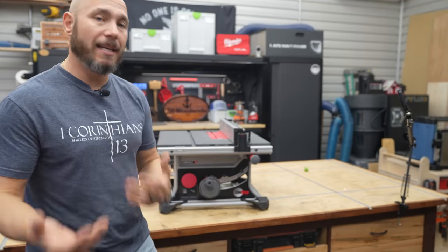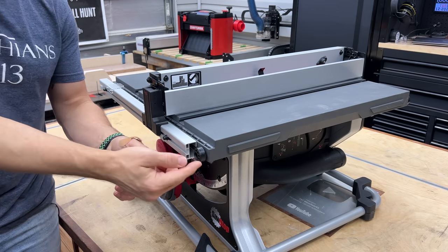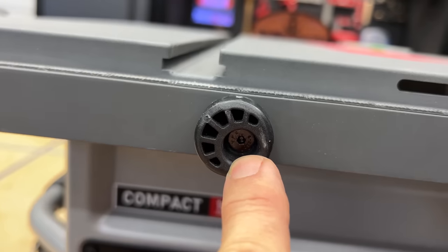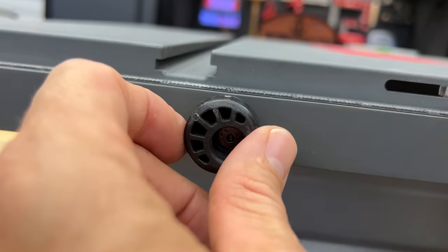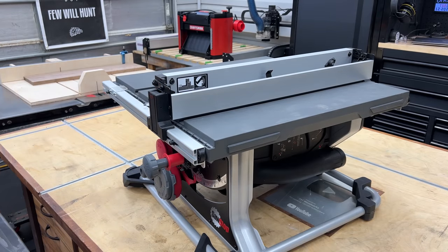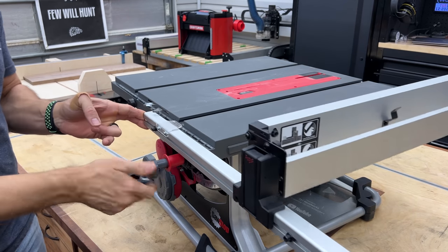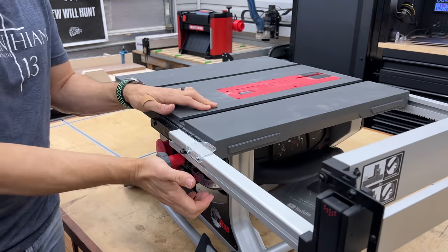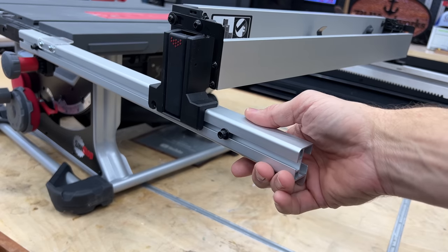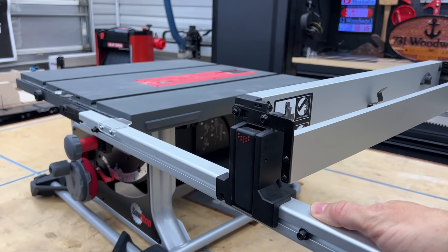To adjust the fence and tighten that play up, it's actually extremely easy. On each of the four corners, there is a cam — it's oblong, not round. You loosen a little bolt inside there and turn that cam slightly until you get the slack out of the fence. Once that's done on all four corners, you have it adjusted so it's snug. You can run the entire fence all the way out, lock it in place, and the vertical movement is essentially gone.